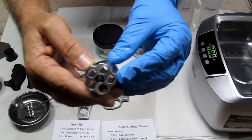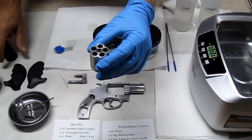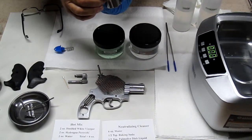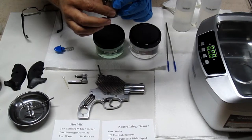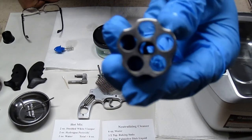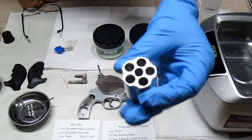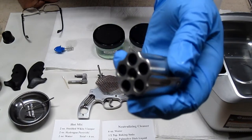You can see that's pretty clean. I'm going to run this another 480 seconds. Let me take a look inside each one of these chambers using my eye loop — that's a two-times eye loop. Those burn rings — they are completely gone. There might be just a trace in there, but those burn rings are completely removed, and they've never been removed from day one. I'm going to run it another 480 seconds just to make sure, but I'm safe to say that's perfect — spotless. Nothing but raw stainless steel at this point.